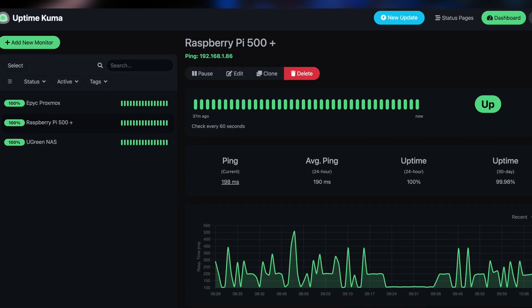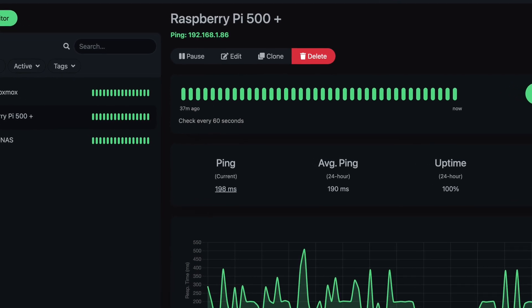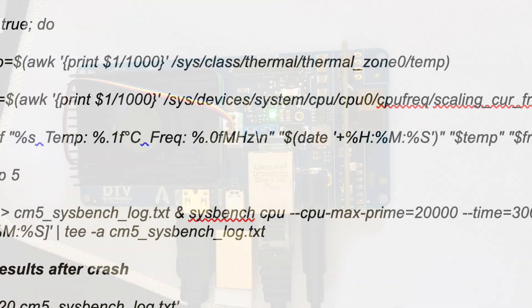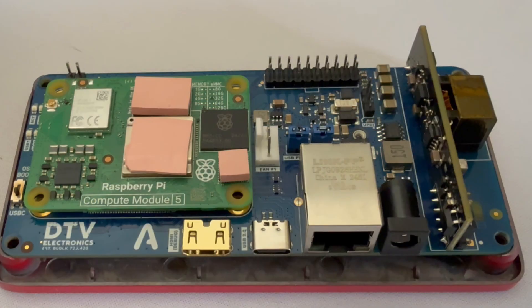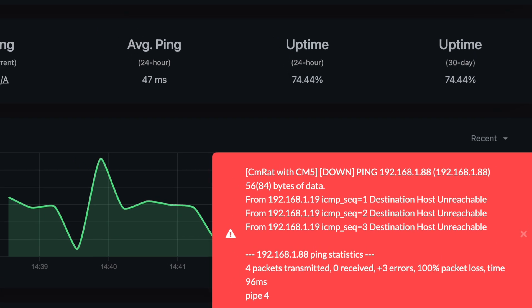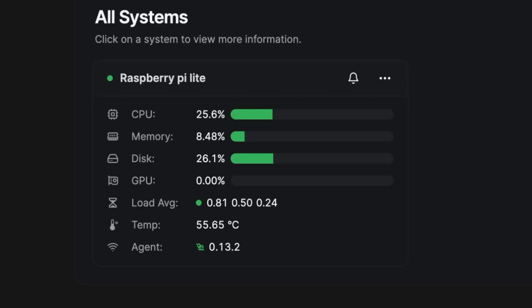To keep tabs on uptime, we're going to be using Uptime Kuma, running from a separate machine, just to see how stable this setup really is. To test how the CM5 handles sustained workloads, I ran a custom five-minute sustained CPU test that logs CPU frequency and timestamps to a file, both with and without active cooling and without the aluminum cover. With only passive heat sinks, the system had an idle temp of 64°C and rose roughly to 72°C before the system shut down mid-test. I performed the test twice more letting things cool down, but it still died after about 80–90 seconds. After adding an active fan, the results were really night and day — idle temp started at 52°C and never climbed above 57°C for the entire five-minute run. The takeaway is simple: the CM5 runs a little hot under heavy workloads, but even a small active fan completely stabilized it for sustained performance.